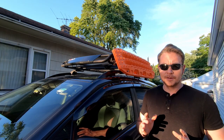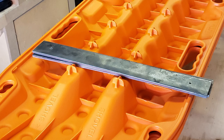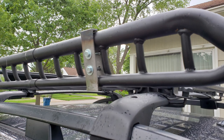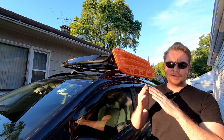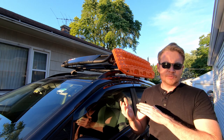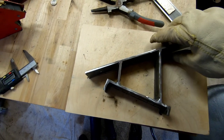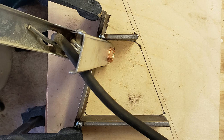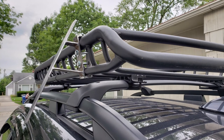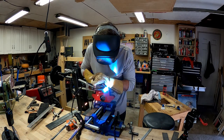There wasn't a whole lot of complicated thought or engineering that went into this build. I basically cut some main plates that acted as a support behind the boards, had a general idea for the clamps, built the clamps first, and then cut the plates behind the tracks second. After I got a mount dialed in the way I liked it, the next challenge was to make another one just like it. I laid out the first one on a piece of wood, traced it out, referenced my measurements, and used that wooden trace as a template to place the pieces of the second bracket and tack it in place as I went. Once it was all tacked, I did a fitment check and then welded it all up.